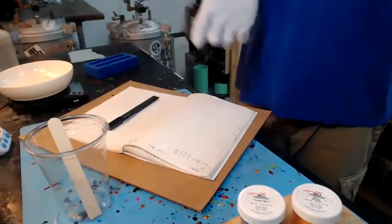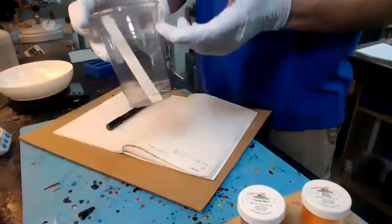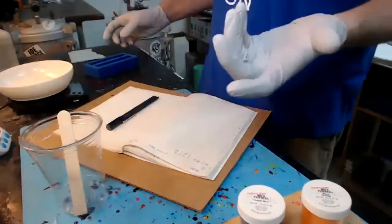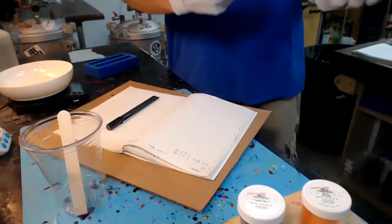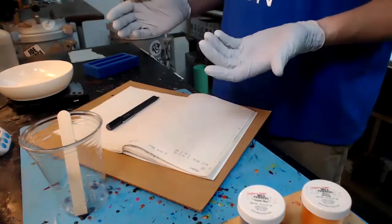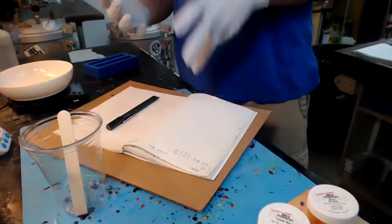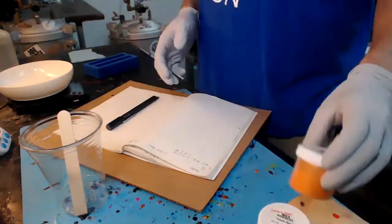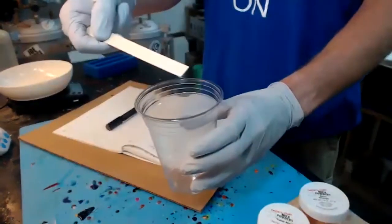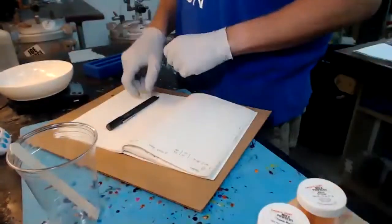Now, with some of them, like lime green, a lot of times there's almost not enough that you can put in the blank to make it completely opaque. For people that aren't pen turners, one of the reasons you don't want it to be see-through is you're going to see the brass tube in there, and most of us cover those up. So some of them don't work as well as others, but generally, once you can pull it out of the cup and you can't see wood grain, you've got a really good pearl effect going on at that point.